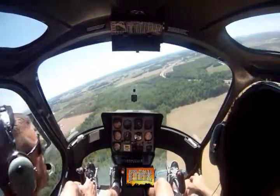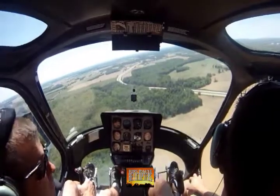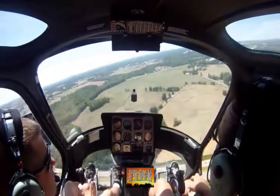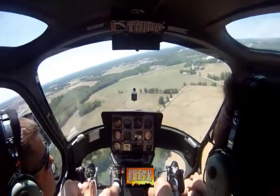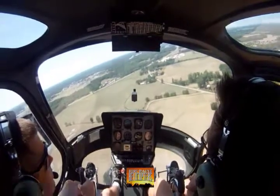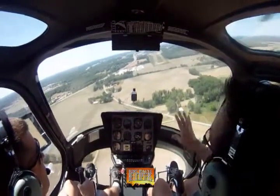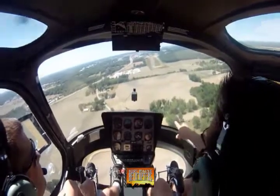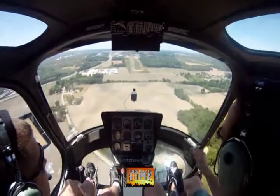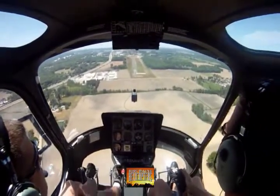If you enter it nice, it's going to be nice. If you enter it sloppy, it's going to be sloppy. Looking good. Airspeed's good. Small rate of descent, but you can clean that up. You can just pull a hair of collective because you're about 1,300. Nice, looking good. You're being set up ahead of time before coming over our tree line down there. Looking good. Nice set-up, man. That's key. Good set-up.